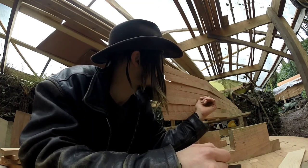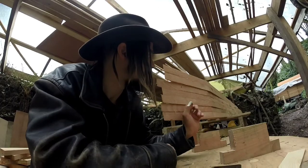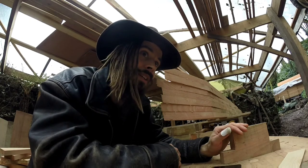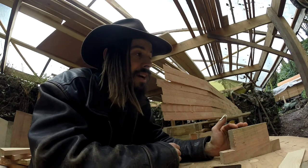We need to cut some of these rafters back. They're scarfed because the width of the shed is too wide for the length of timber that I've got, so we're scarfing them together to get the length that we need. So we'll be slotting them in place and joining them on the scarf,